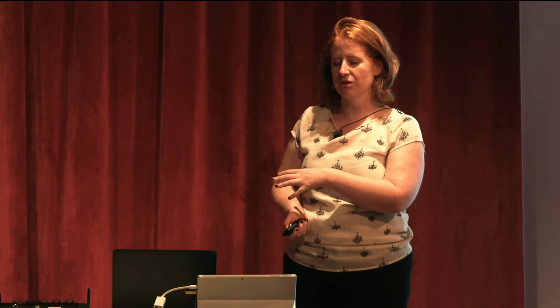Great. So let's dig a little bit more into the different wireless protocols. There are going to be three major protocols that we talk about today. The first one is wireless Ethernet, like what's in your router, and the example we're going to use is setting up a wireless router for your IRFR app, because that's a common thing that we do in theater. The second is the GDS ARC system, which is a mesh network. We'll dig into that a little bit. And the last thing we're going to look at is the color source relay, and we're going to deep dive a little bit into wireless DMX, since I think that's kind of what you guys are really here for, and it's probably what you're going to be struggling with the most out in the field.